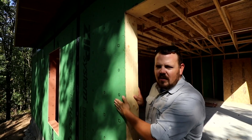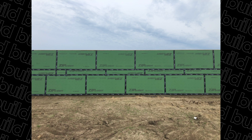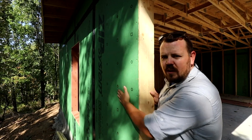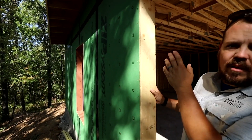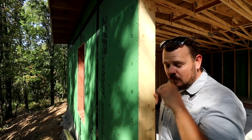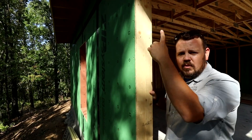The product you're seeing right here is just standard zip sheathing. We are taping it to the foundation or we are liquid flashing it to the foundation. We're detailing it in the panel. We're not worried about nail heads that are not overdriven — obviously if fasteners are overdriven, we're replacing them and patching that hole. That gets us all the way up to the top plate. Basically we have whatever sealed us to the concrete, the zip sheathing, and its tape or liquid flash, and then we're ready to move up top.